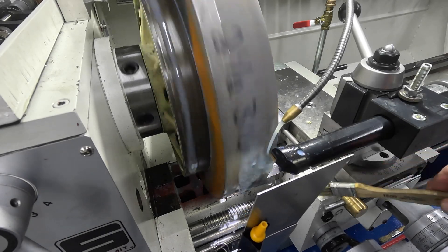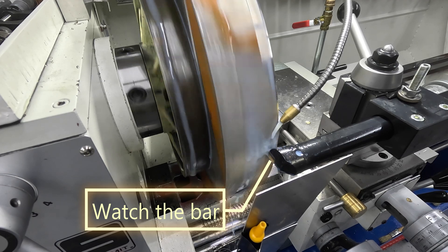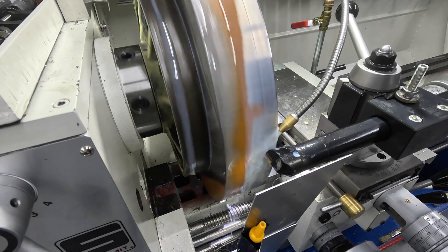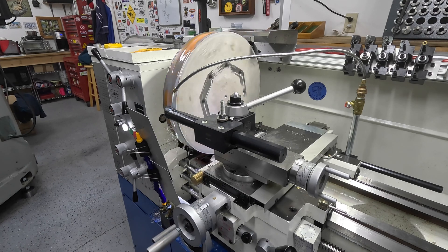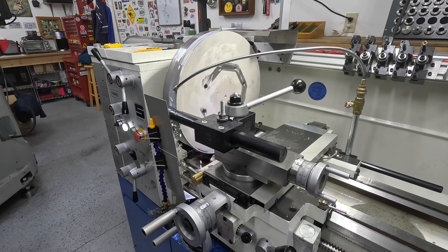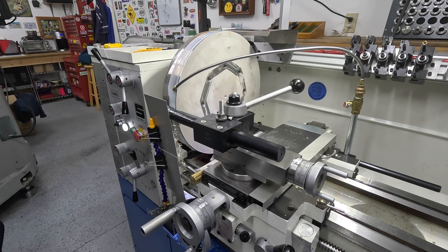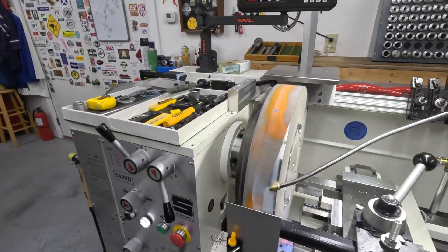This view really shows the challenge in making this part on this machine. You can see the boring bar deflect — it would have been really a good idea to come up with a more rigid setup because this prevented me from taking reasonable size cuts. The thud that you can hear occurring here is from an interrupted cut. There's a groove running across the outside edge caused by the water jet, which is the initial pilot hole the water jet made when it cut this slug out of the main material. That's coming around and hitting the insert and causing a heck of a thud.